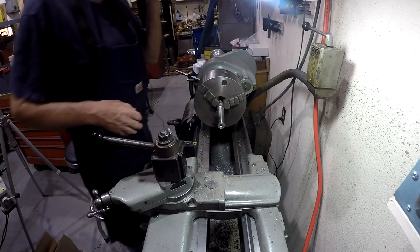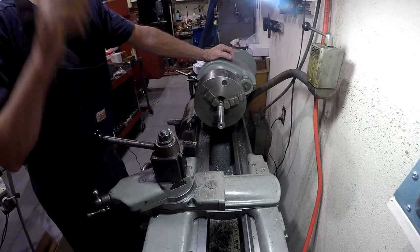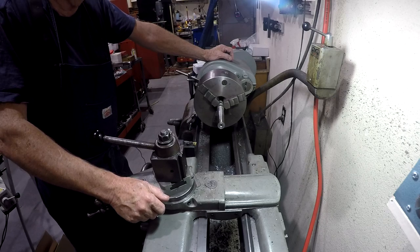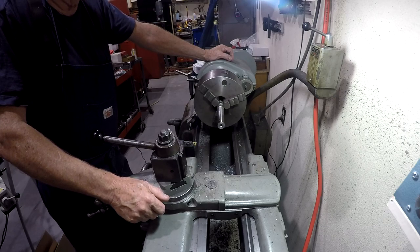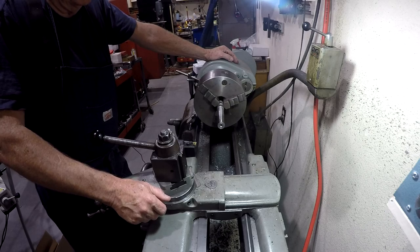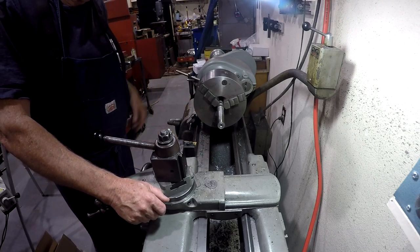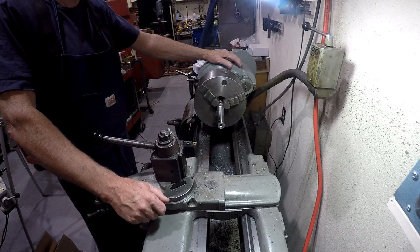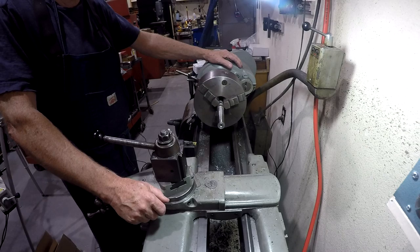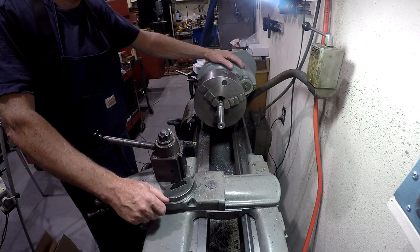But the other thing that I use these for, and it's not a lot because I don't build a lot of old engines, but in restoring antique engines, you can use those to set the governor on them. And one of my engines has a governed speed of 500 RPM or 550, I can't remember. And you could set your governor there. Most of the guys that do old antique engines, the hit and miss engines, like to hear them pop and then coast a while and then pop. And you get a better effect if you tune them real low. So we wind up setting them lower than the factory governed RPM. But at least you know how fast it's turning.